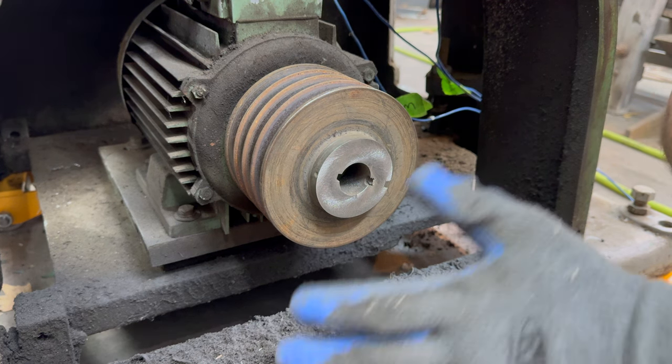When removing the paint on the belt cover, I thought it was kind of interesting to see the different layers. It seems like a lot of the metal on this machine has a red layer, some kind of a primer or sealer that was attached to the cast iron or metal. That stuff is incredibly hard to remove by chemical means. On top of that, there's a black filler material, which can be made soft with acetone. Then there's a green layer, which I believe was the original color of the lathe. And then on top of that, somebody painted over it with a light gray, which is the flakiest of all the paints.